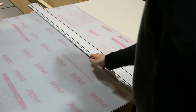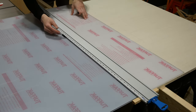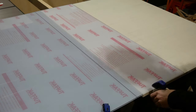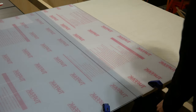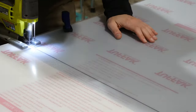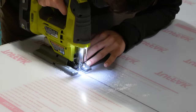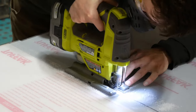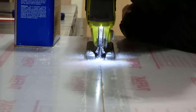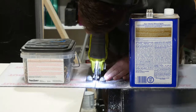Now I needed to make the frosted glass panels. You can use plexiglass or polycarbonate as it's stronger and often cheaper than glass. To cut a large sheet down to the size of the panels I needed, I started by using a long straight edge to mark a line across the plexiglass. The key to smoothly cutting it is to clamp it down and support both sides of the cut so that it can't jump and move around. Then I cut down the middle of my marked line using a metal cutting blade on my jigsaw, making sure that the saw oscillation was turned off and using a moderate blade speed. I cut about halfway through the sheet and then came back from the other side to finish the cut. Then I cut this smaller piece into my panels using some weight from around the shop to act as clamps.